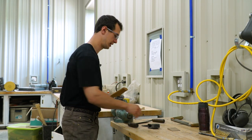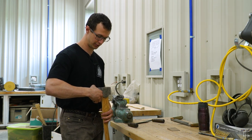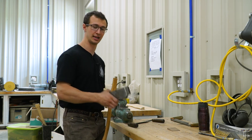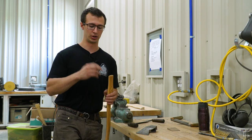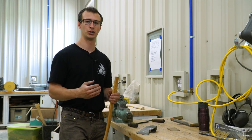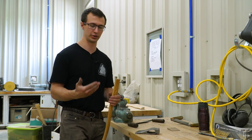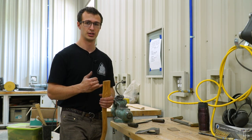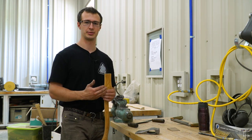The first step is going to be putting your axe head on top of the axe handle and seeing how close the fit is. Since I'm putting this handle on one of the axe heads that I made, this is a pretty close fit to start with. We make it like that so we don't have to do as much work, but we also make these axe handles to a size that will be very close to most other axes in this weight range. So depending on your axe, you may have to remove more material. If it's a little bit loose of a fit at first, then all that means is that you'll use a bigger wedge.